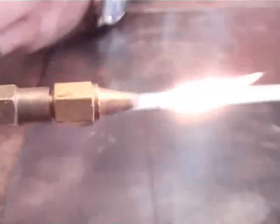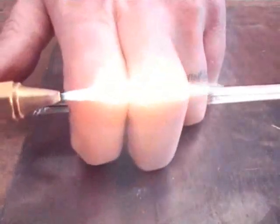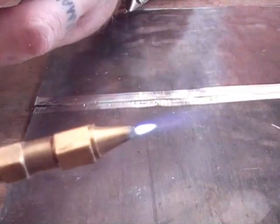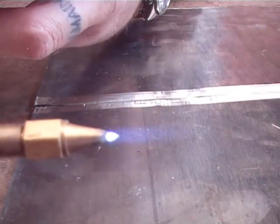When you light your blowtorch, start with the acetylene. You need about 2 to 3 inches just to get you started — if you haven't got a tape measure handy, just gauge it by your fingers, so 2 to 3 fingers worth of acetylene. Then bring in your oxygen; as you do, you'll see a feather appearing. Keep increasing your oxygen until that feather goes down to a nice round tight ball.